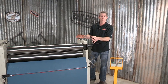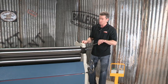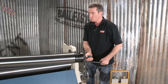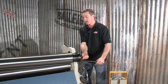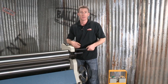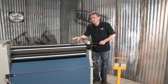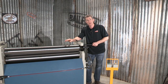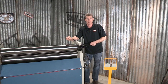Once we've got it rolled on this machine, we would simply pull this pin, bring this down, and pull our roll out, and we can slide that material off. Bring that roll back and we're ready for the next roll. These rolls are six inch or 150 millimeters in diameter. The minimum roll capacity on this machine is one and a half times that top roll.